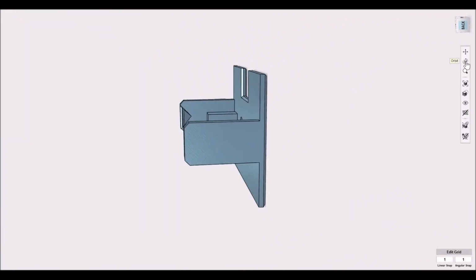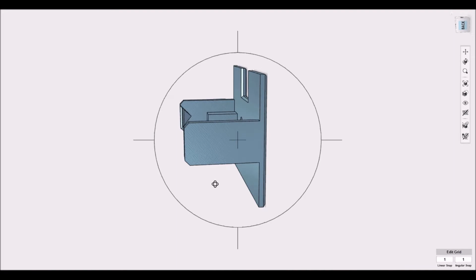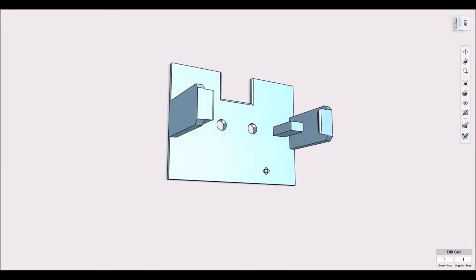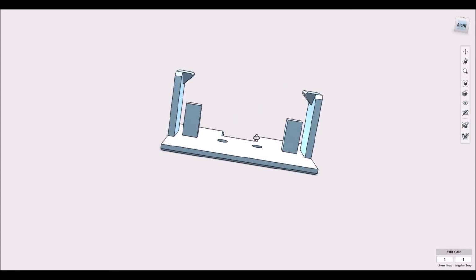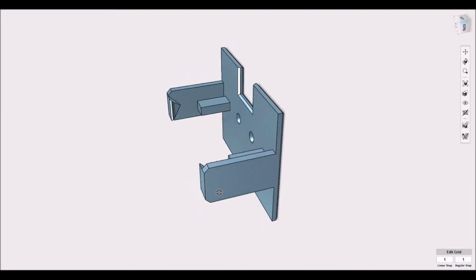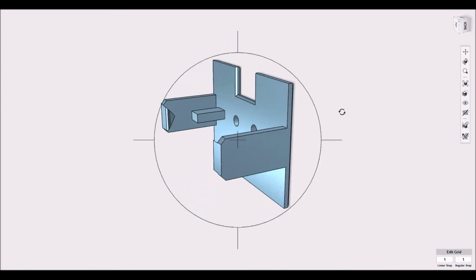This clip goes at the back of the sensor shroud to hold the sensor securely in position. It features a couple of bosses that position the sensor module and a couple of side spring clips which hold the backplate onto the shroud.